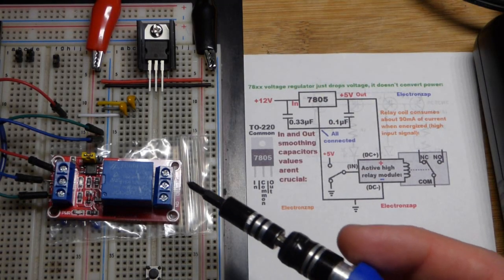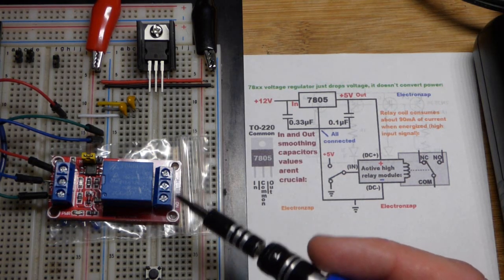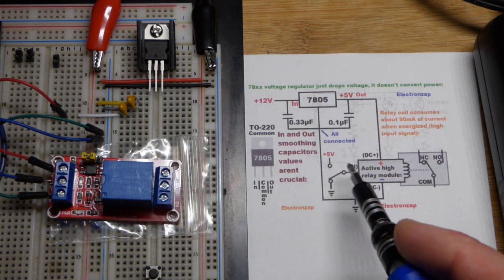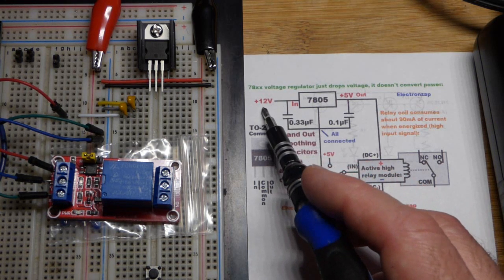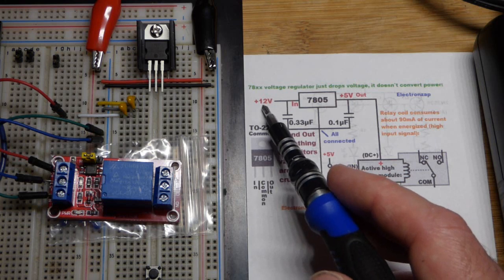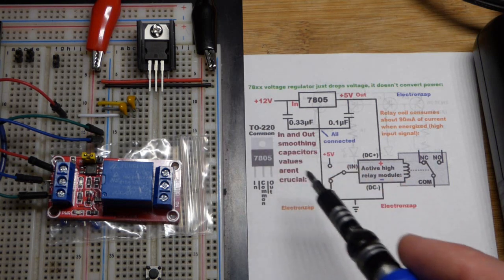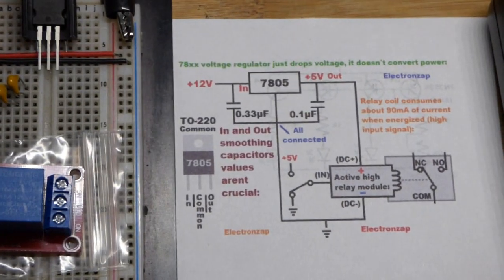I've been thinking about some higher-power circuits that I may want to control with a 5-volt relay. The switch part of the relay can handle a lot more voltage than 5 volts, but the relay itself would be a 5-volt relay if I use a 5-volt relay module. I decided to use 12 volts for the example in this circuit. Sometimes I'll be using more or less than 12 volts — thinking of charging and discharging batteries. There are 12-volt relays which may work, but since we'll drop below 12 volts, maybe it won't. So we'll make sure we have 5 volts going to a 5-volt relay no matter what.